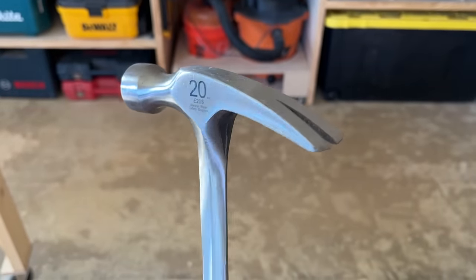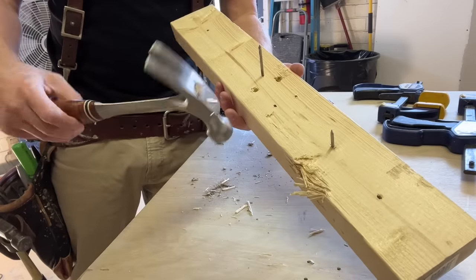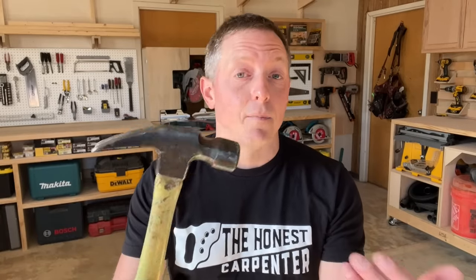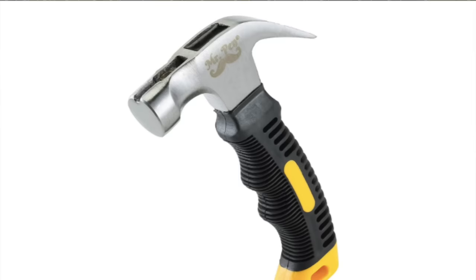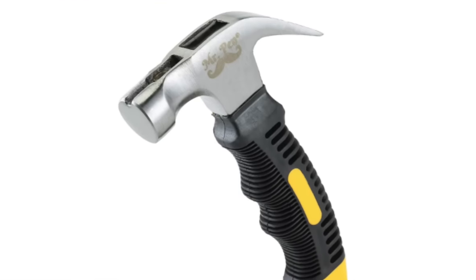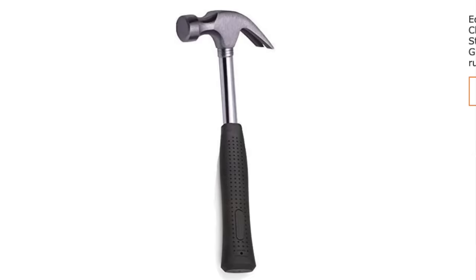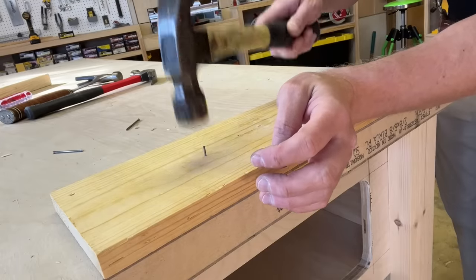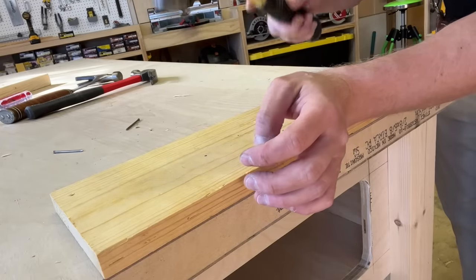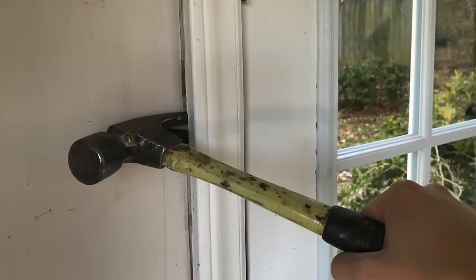Conversely, this beautiful S-wing is 20 ounces, and while I may use it a lot for framing heavy jobs and deck work, it may be overkill for general work. 16 ounces is just the bare minimum for effectiveness, and every rip claw hammer you come across is going to have that or more. Whereas tons of curved claw hammers come in these rinky-dink weights, like 10 ounces — they get marketed towards homeowners and look unintimidating, but they're so ineffective they're almost useless for driving anything but little trim nails. I say do yourself a favor: get a 16-ounce rip claw. You can still drive trim nails and picture nails with it — I do it all the time — but you can also drive framing nails and common nails, and you can break things up around the house and tackle projects more efficiently.